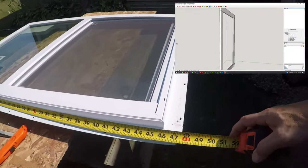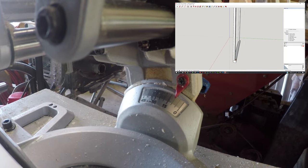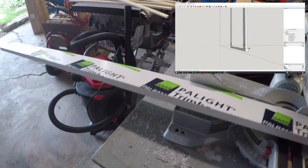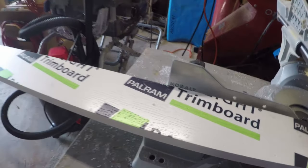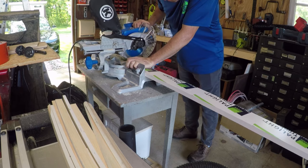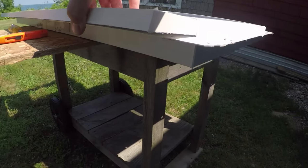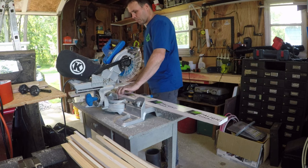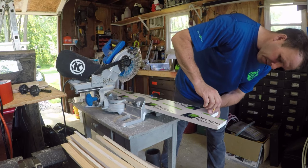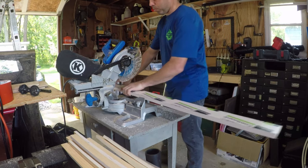A friend recently asked about making window trim for a cottage. I've made PVC window trim for a seasonal dwelling using simple PVC trim boards — 1x4 PVC trim — along with standard fasteners and some caulking. The windowsill is the unique part: there's about a 10-degree bevel on that board which allows the sill to have that classic look. It's like a one-and-a-half by one-and-a-half with the 10-degree cut on it.